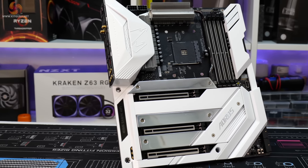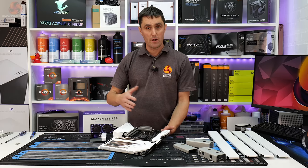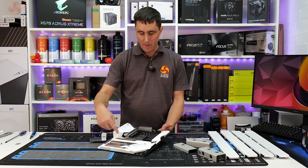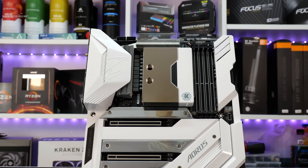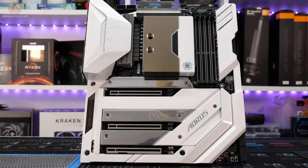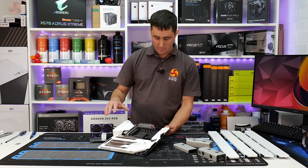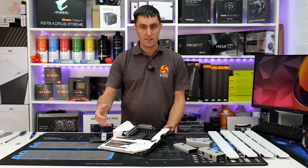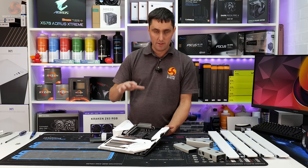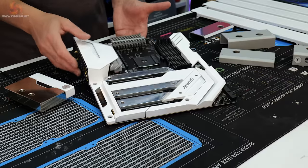So all these have been sanded down, starting from a 120 grit right up to a 2500 grit and then polished. So they've got an almost mirror finish to them. So really nice shiny silver finish. The heatsink on the VRMs as well, that's had the anodized coating stripped off it as well, and that's just bare aluminium. And then those parts have been sealed as well with a sealer to help protect them from corrosion. So motherboard's looking good so far.